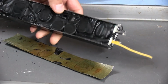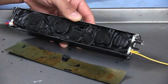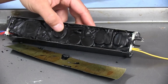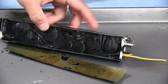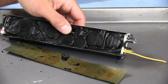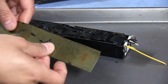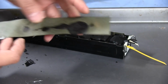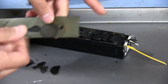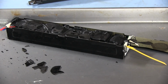Alright, we'll set that aside. So, what can we see so far? Yeah, that's 2 electrolytic caps right there. We're also going to have some transformers and some inductors and stuff hidden underneath these things. So that's kind of why I froze this. I wanted to hopefully make the tar as brittle as possible. You can see right here in this kind of protective layer that they have in the back there, there's some tar there. It cracks fairly easily because it's cold and crispy, so I'm hoping that will help with digging out the board in there. I should probably get a little bit more light here.